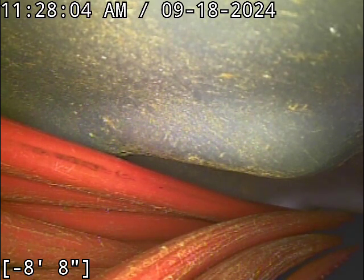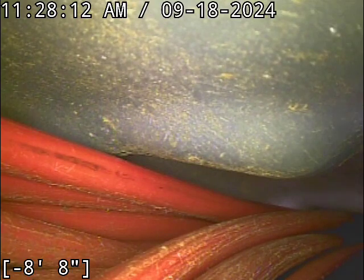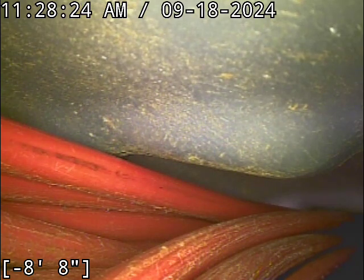There's a lot of things working in your favor here to keep things humming along. And there's no evidence of past blockages there, and I really wouldn't expect to see that. Not unless I also saw the line loaded up with wipes and things like that. That's the kind of stuff it would take to get that to a point of blocking, is abusive items. And then I will notate on the report, possible roots at 9 feet.